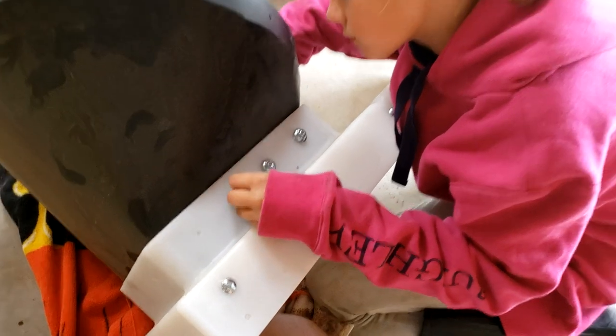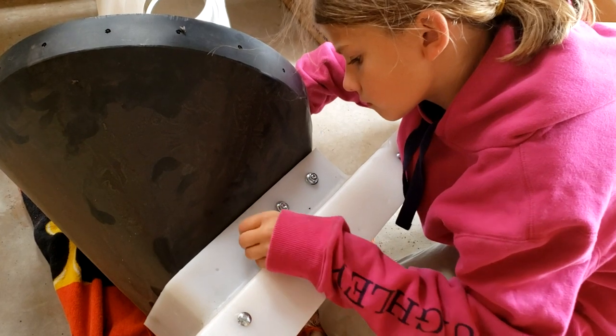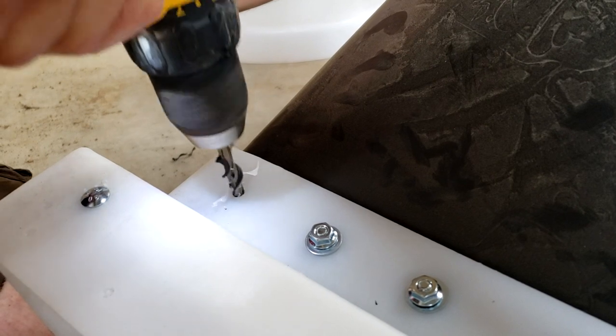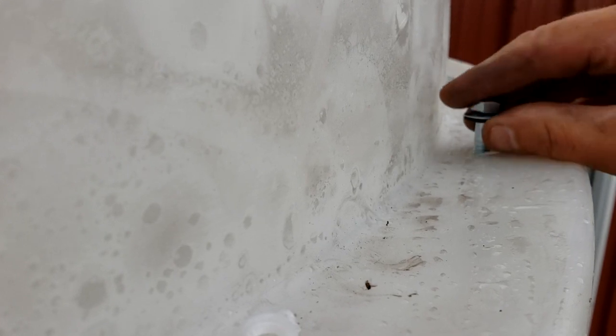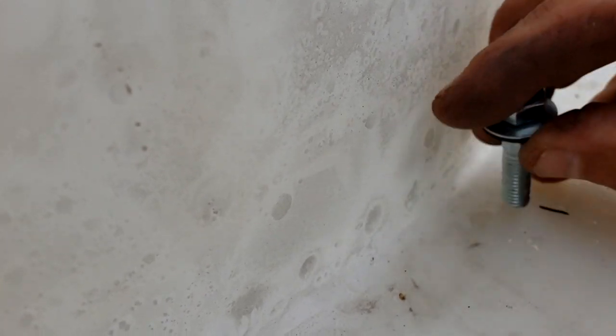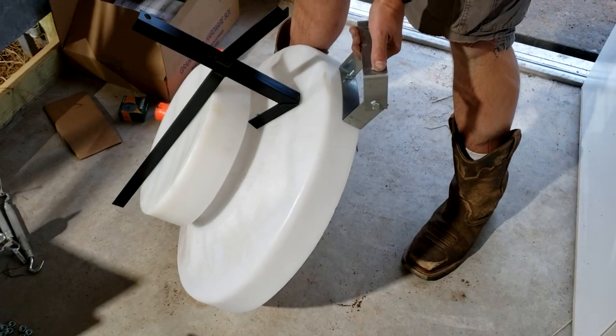It still had to be somewhat assembled and reassembled. The bottom did not have the angle I needed — I needed a 45-degree cone at the bottom. They make them in 45s, 30s, and a flat 90. So we did have to redrill that and put that on. It also wasn't set up for an auger, so I had to put the auger mount base in too. When putting the top together, I used all new hardware — new bolts with rubber cushions to help seal it — and I did silicone the seam. Some holes matched up and I could just pound them in; others I had to drill out.